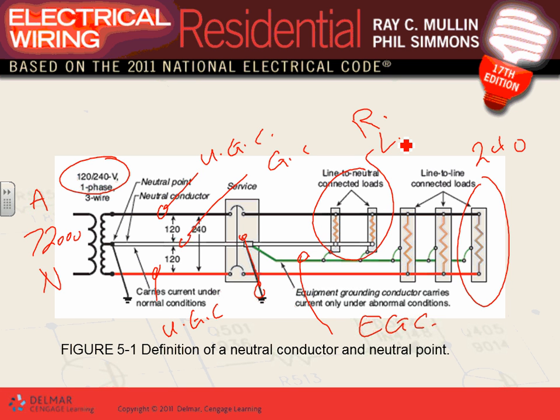That's a major concept. In many countries in the world, they only use one voltage in dwellings. They deliver 220 or 230 or 240 or 250, and they run everything in the house at this voltage. So in the US, we split the voltage into two. Safety is the main concern. So if you go to France to work there, you're not going to see this. You only see just one voltage, 240. Hot to neutral, done.